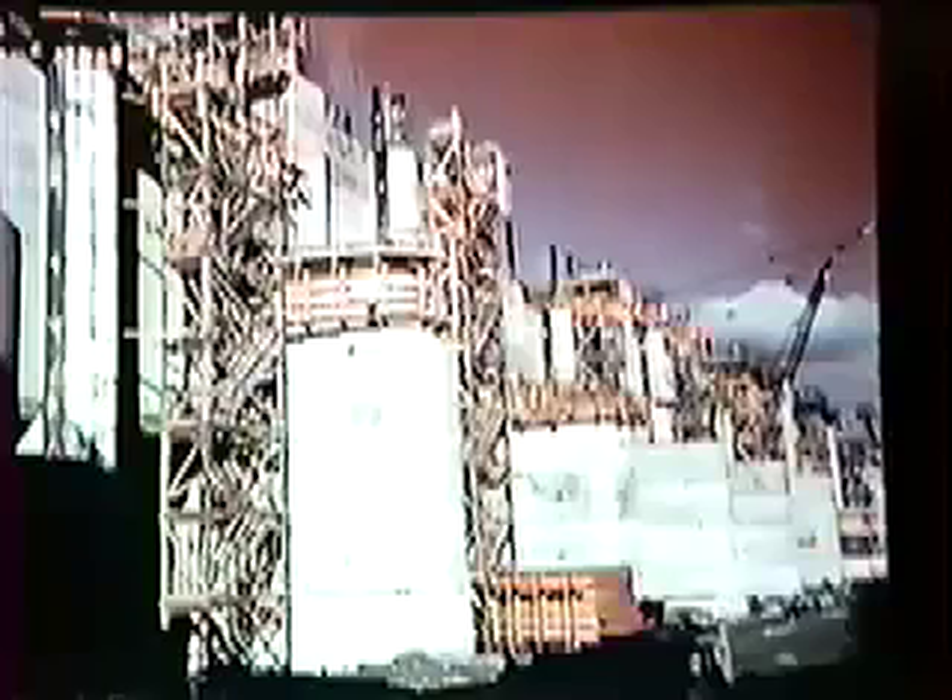The storage reservoir itself and the conduits run under the city of Niagara. This is the starting of the upper pump storage plant, and this is the base where the turbines are installed. They have these mammoth cranes that roll back and forth to bring in the concrete and the steel. Here are the pump storage generator turbines — these turbines act as a generator when water flows in one direction, and as a motor in the other.